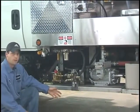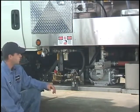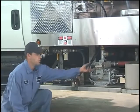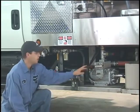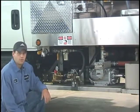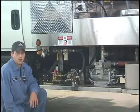The first thing I'm going to go over is running the vacuum pump. When you get ready to pull vacuum and start sucking out a toilet, after you've turned on the PTO and brought the truck's idle up, you're going to pull the handle all the way out on the vacuum pump — this is the vacuum mode. Once you have the handle all the way out, you just push the directional valve down. The truck will begin to pull vacuum, and the vacuum relief will cut the truck off at 18 inches of vacuum and hold it there.